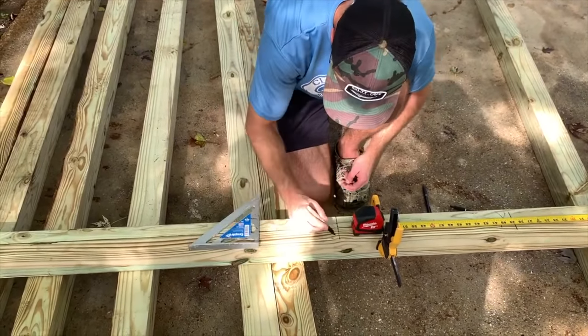So here I am establishing the chalk line, which will leave me with a 1/4 inch overhang over the rake drip edge, and I couldn't show myself snapping it, but you're going to snap that along the top of the shingles. Then go back with a hook blade on your utility knife and trim all of the excess off. You can also use some heavy-duty snippers to cut off the overhanging shingles, but this is not recommended. I think a utility blade is the best way to go. After trimming off any of the overhanging shingles, your shed roof asphalt shingle installation is now complete.